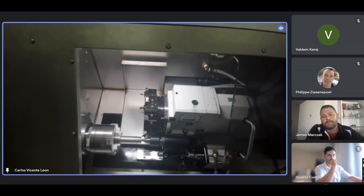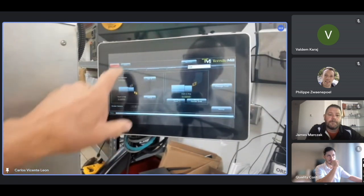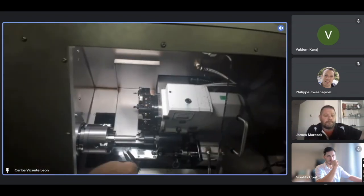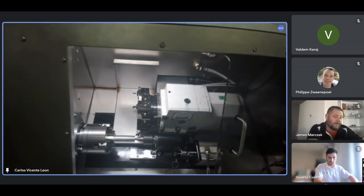Now at this stage, do not move the axis on the diameter, on the X. Just move the Z, because we don't want to lose that reference. Go back here. We'll stop the spindle. Go again to home CNC to reset. And we measure the diameter. It's 0.945.